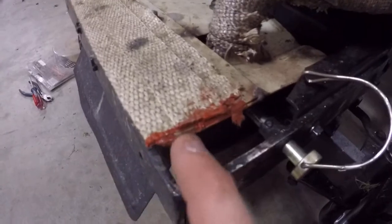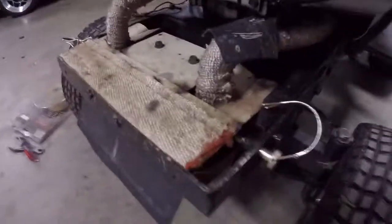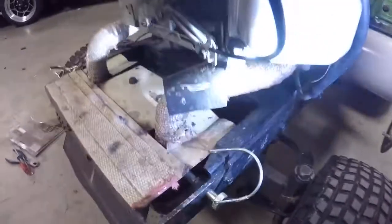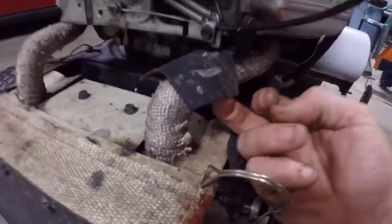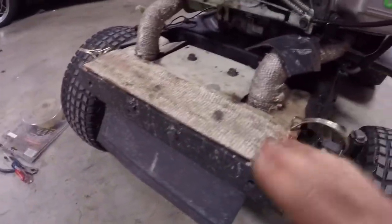You could wrap it underneath and stick it on the underside so it looks nice, but it's functional for what I do. It still had a problem with melting the cable, so I made this little bracket. All it is is it bolts to the edge of the valve cover right there, and underneath it I put a couple layers of exhaust wrap. That finally stopped it.